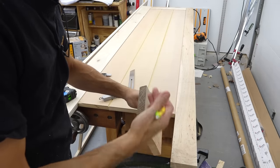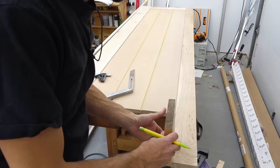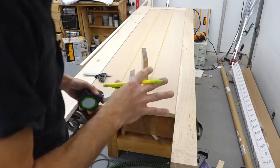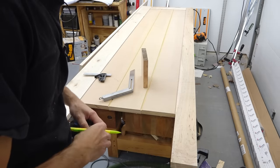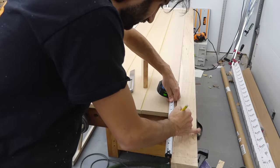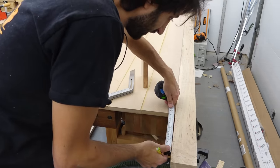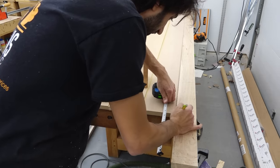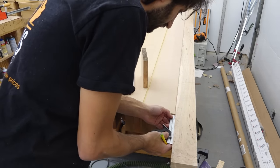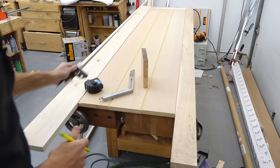And this is the riser that'll be applied. And that's gonna end up being somewhere on here like this. So everything over here and on doesn't get seen because it is covered beneath the actual stairs. And I know my riser height on the framing is 7 inches right now. And by the time I actually get my tread on there, I can include that later as well. That should be about 3/4. So I have a 7 3/4 inch rise on that first step. Right around there. So this is the first spot that is visible above the staircase.